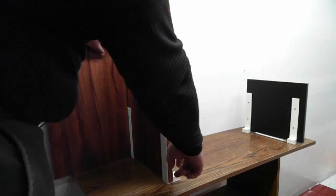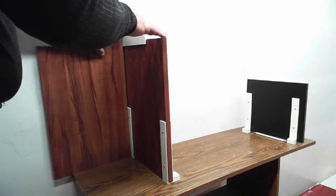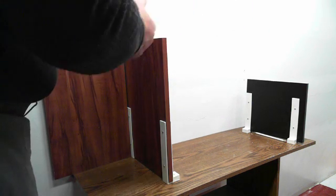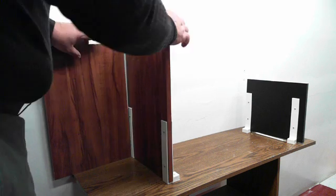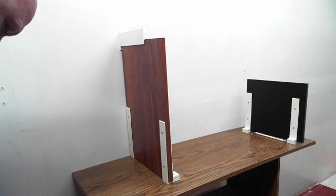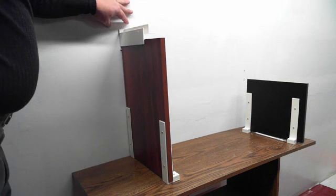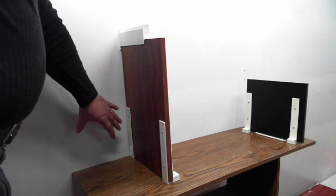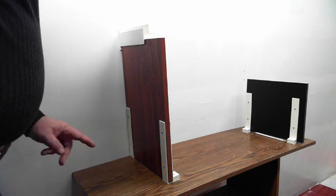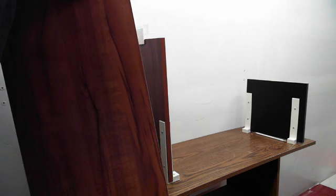After this is secured, then you screw to the bottom, keeping it true to the floor and true to the wall for your first piece. The next step you do is do the other side of the bookcase, or however you're going to move up the wall. The next step after that, believing that you have a variety of different lengths of paneling, if the next shelf is up here, you could actually just take a longer shelf and just keep going up the wall using the straight cuts of the bookcases as your straight edge.